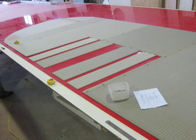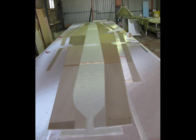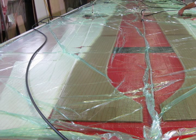The process starts by precisely cutting and accurately locating the core and glass to enable the panels to be bent to the required hull shape. The hulls, decks, bulkheads, bunks, hatches and shelves are made from two infusions on the 16 metre by 4 metre table. Each infusion takes two days to set up the materials, a couple of hours to put the bag on, then 40 minutes to wet out and consolidate the entire panel.